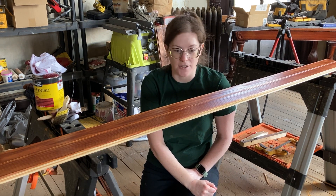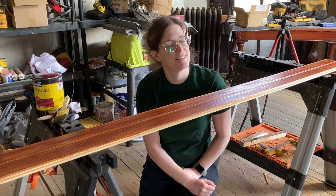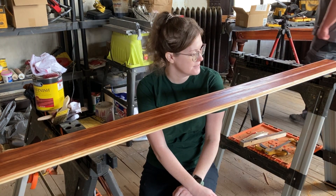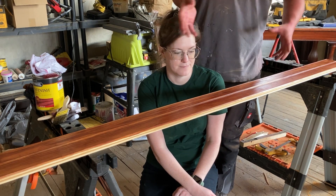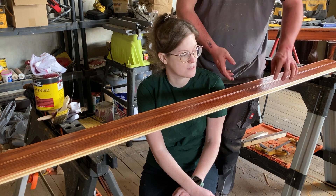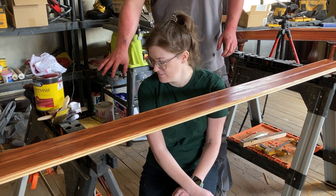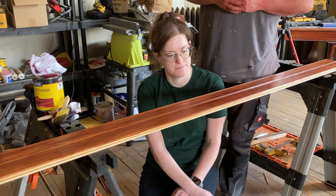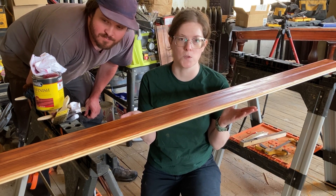I'm surprised we came through with it because I thought that was not going to work out. Remember: if you don't like the color, just keep adding to it — typically that'll work, at least with shellac. As you keep going it gets darker. There's also a product like Zinsser that you can buy at big box stores — it's shellac, but that stuff's always orange. Because we have the darker garnet flakes, as you add more it gets darker and darker and the color gets more red. So the next video is going to be me shellacking a bunch of stuff. See you in the next one — take care, bye!